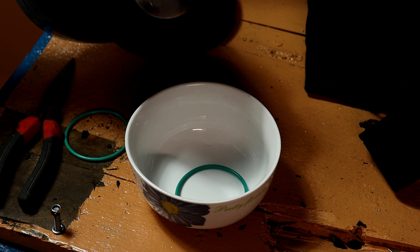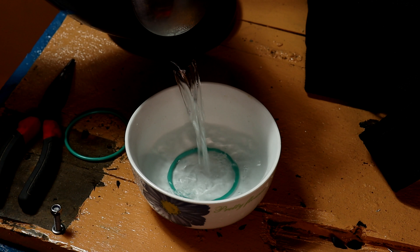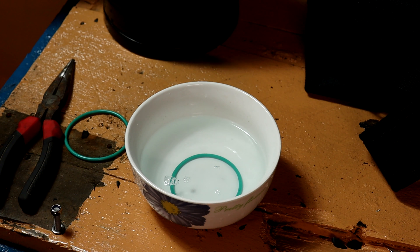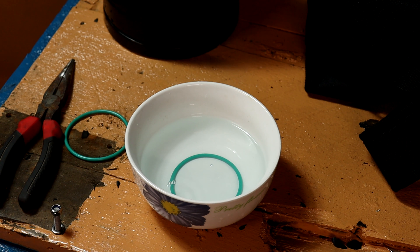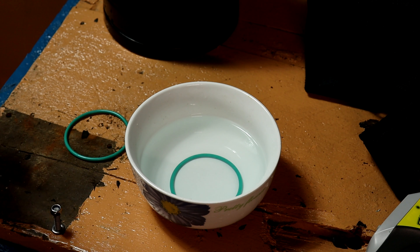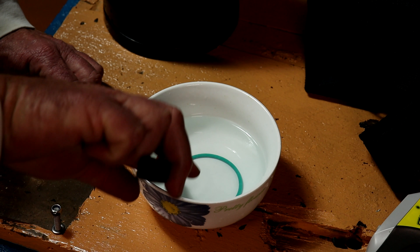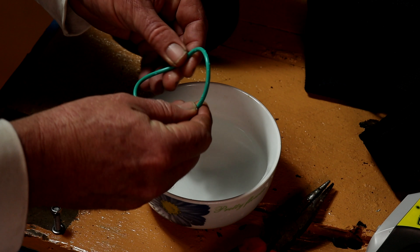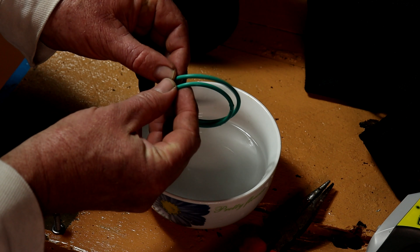The first order of business is to test the o-rings to see how they're going to handle the heat. This is a bit of a backyard idea — boiling water into a container — and just check the temperature. It came in around 80 degrees, so the container obviously absorbed a fair amount of the temperature. We'll just make sure the o-ring didn't deform, go sticky, or anything weird like that. The end result: nothing to report really, so quite happy to use it.